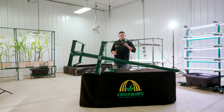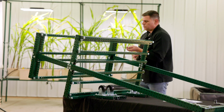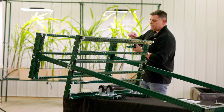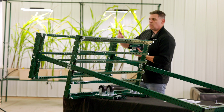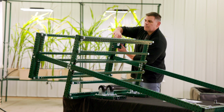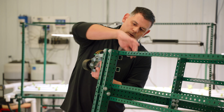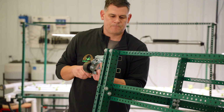So the first one we'll do is one of our swivel casters. So we'll begin with a 4.5-inch bolt and a washer. And we're going to want to orient our swivel caster so that the outermost support piece is leaning up against this 1-inch piece of tube steel. And we want to align hole number 1 and hole number 3 with our 2 pieces of rectangular steel.